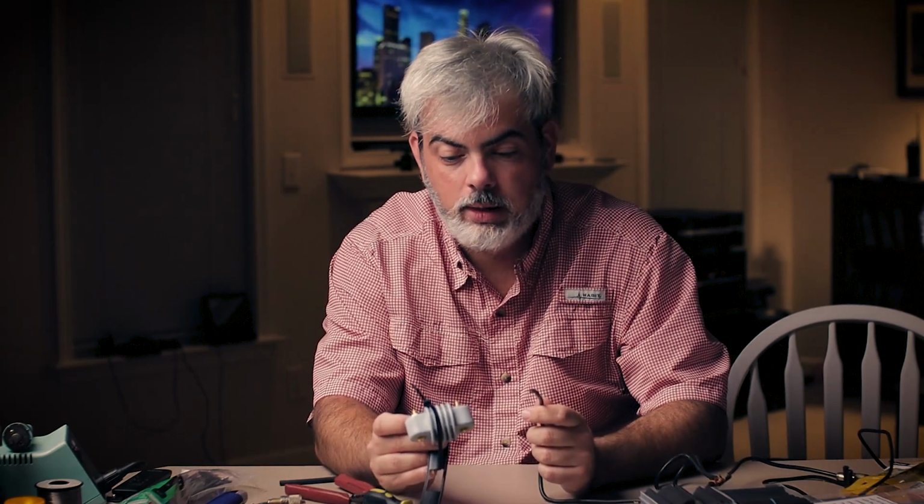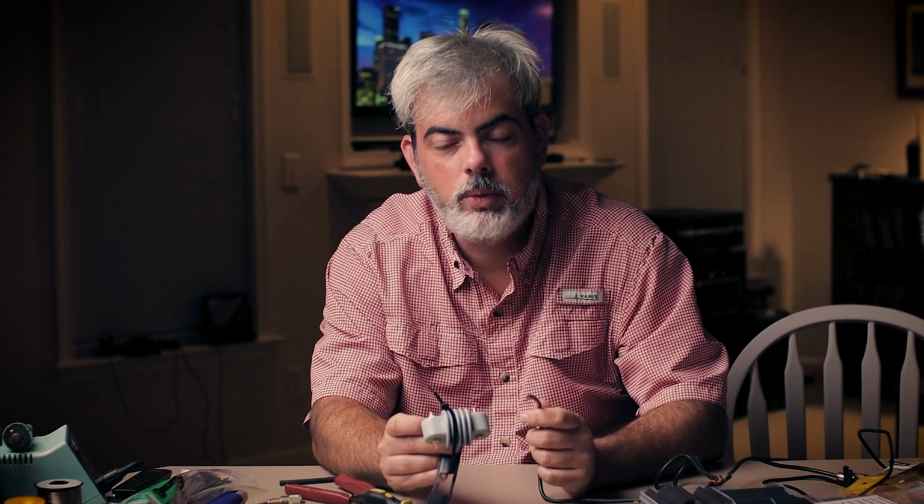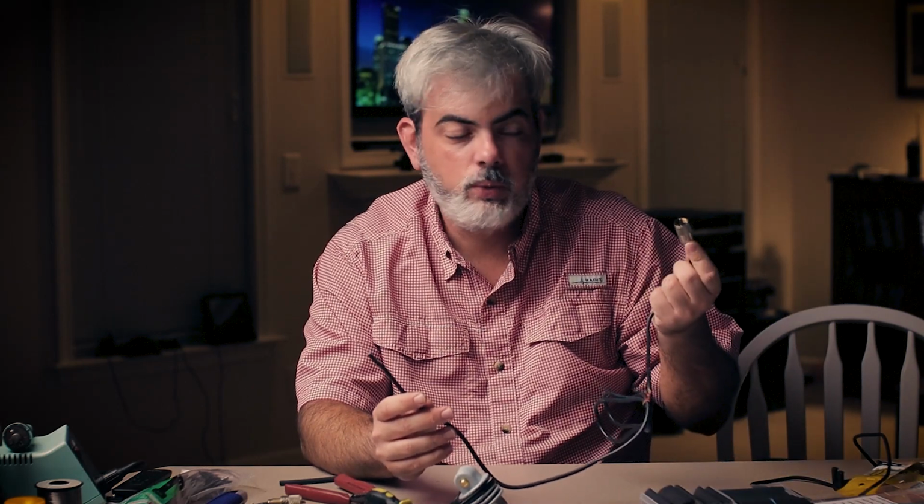So now we're going to talk about prepping your coax to mate up to the ladder line that we've made up on the center insulator that we did in the previous segment here. What you're going to do is take a length of coax. If you got a jumper that's already terminated with your PL259, that works. There's nothing wrong with that. I would probably, in this situation, if you're doing it for the ZS6BKW, go ahead and get the coax long enough to make your choke.